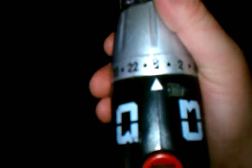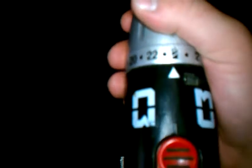What I am using is a simple Craftsman hand drill, a power drill. You can use any drill, but what I would recommend is having your clutch set to a lower setting. I have it on 7. You should never, when you're assembling something like this, have it on the highest setting, or you'll strip the screws out extremely fast and easily. It'll cause headaches. So take the clutch on your drill and turn it down. That way you're not going to have any stripped screws.